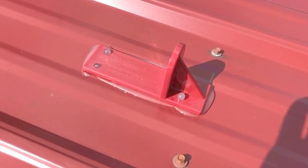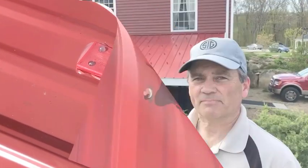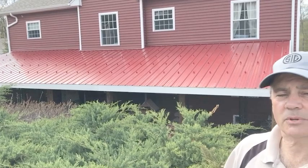This will provide complete waterproofness of the adhesion and long life of the snow guard. Behind me you can see the finished product — the staggered pattern of snow guards on the roof. These snow guards act as cleats, distributing the snow load across the entire roof surface, preventing snow movement and snow buildup at the eaves, which would cause structural imbalance, possible damage to your gutters, and ice dam buildup.